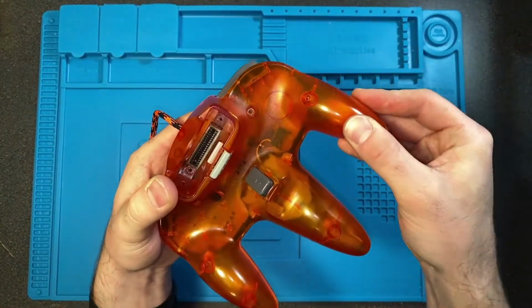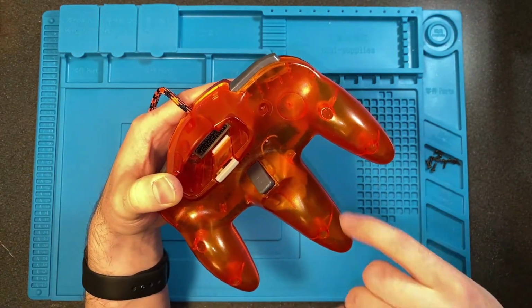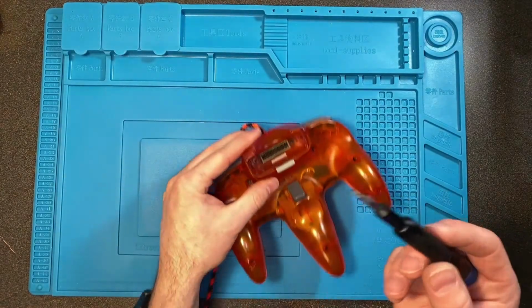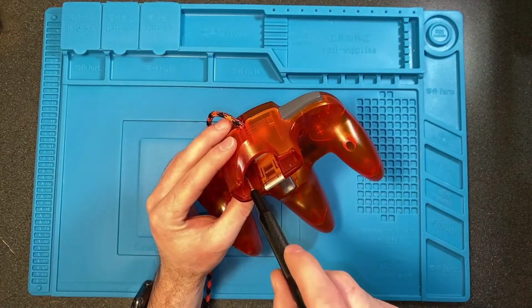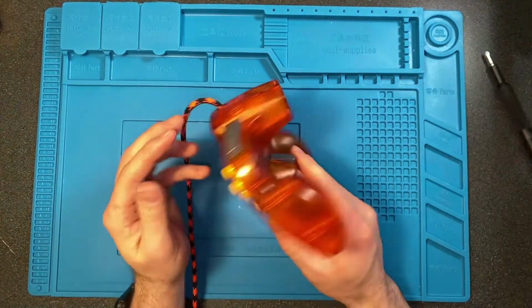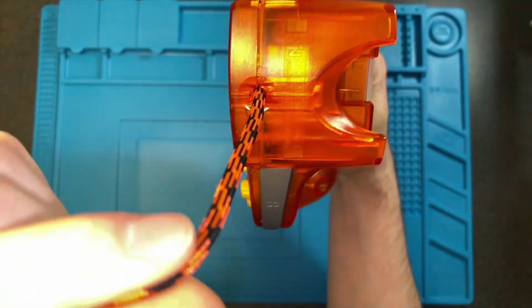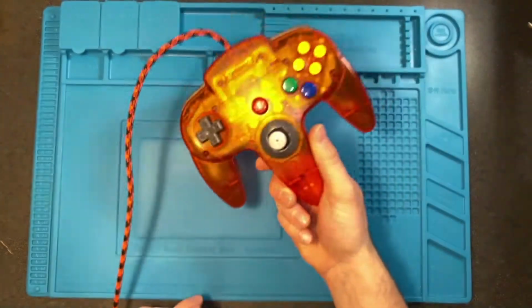And then once you have everything back to where it needs to be, you're going to put your 9 screws back in all the way around. And again, definitely recommend having a screwdriver with a magnetic tip. It makes installing these deep ones so much easier. So line those up, screw them down, and once everything is tight, you should have a nice end to the cord there, and then we can go ahead and go over to the plug end.